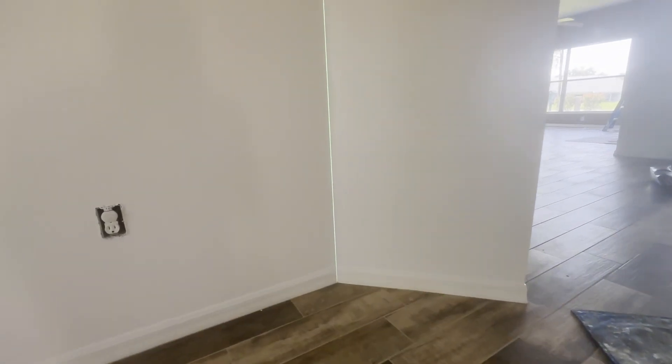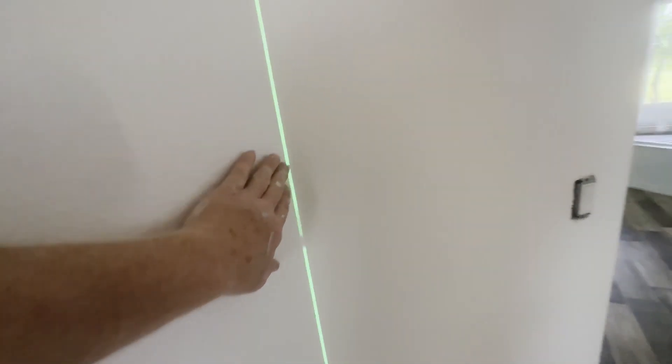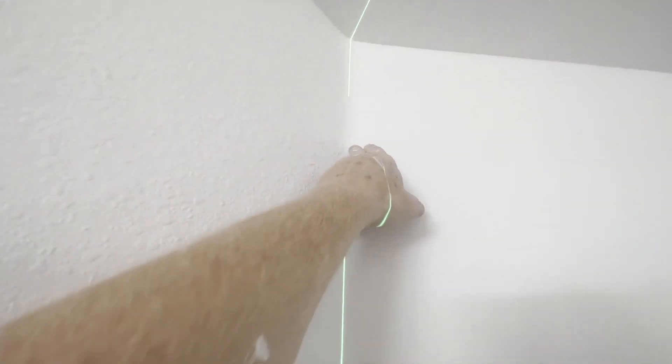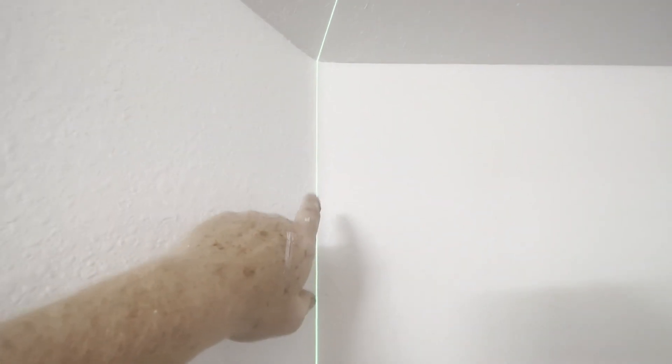Reason prevails, and I'm going to find the center of my corner. I think it follows right from the trim. You may find that the person who did the drywall finish is not consistent with the corner going up, but if your line is consistent - at the top, the center of the corner is not on the laser. So the paint is going to be critical that it's straight, because that's going to define, at least visually speaking, the center of the corner.